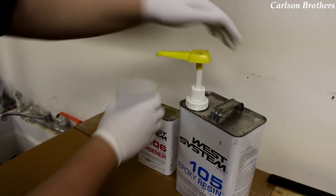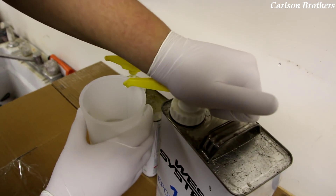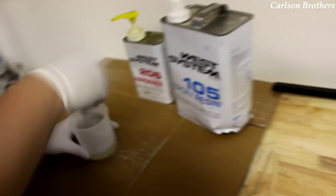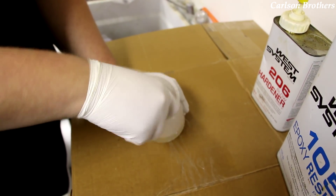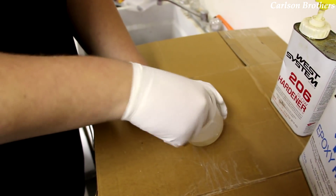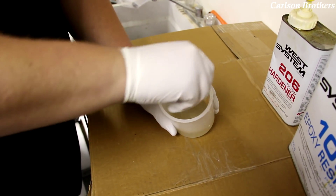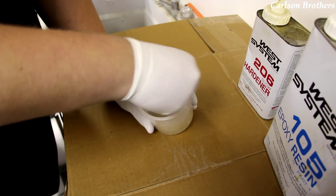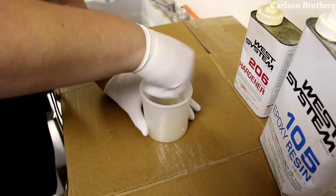You kind of need some expensive epoxy to rely on when you're going Mach 2 or Mach 3. So that's what we're going to do — mix it up real quick. The pumps make it a 1-to-1 ratio, so I'm going to do 4 pumps of each. This epoxy has a ridiculously long cure time, which is another reason I recommend it. And it doesn't smell like ass like other epoxies — it smells sugary, like cereal. Don't eat it though. For composite work beginners, I definitely recommend an epoxy that takes a long time to cure. This one starts curing between 4 and 6 hours, takes a full 24 hours to cure when warm, and can take up to 48 if it's a little cold out. Luckily we're in the heated garage.